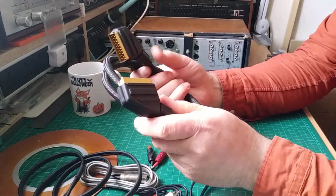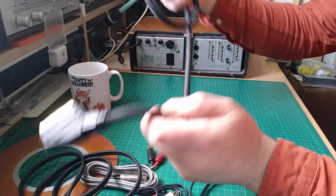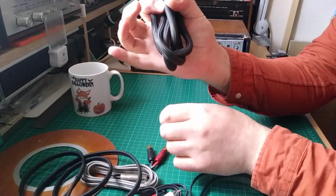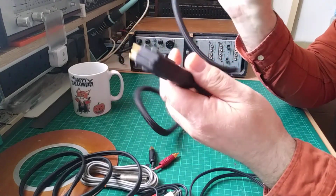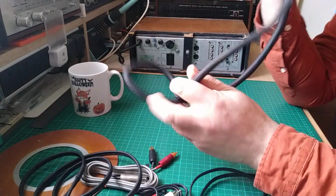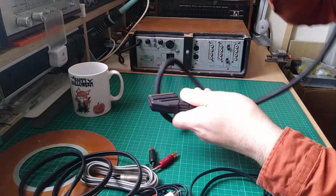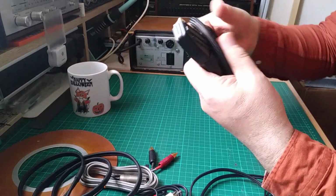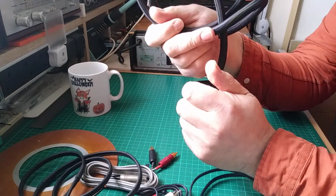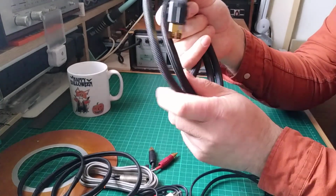This is one of the cables that I used to make when we used to make SCART cables, and as you can see, this is quite a flexible cable, and it's also quite a high quality one as well, because all the conductors in the cable inside here are all individually screened, and they're all properly terminated, because as I say, on some of the cheaper ones of these, it's just basically a multi-core cable with just a thick rubber sheath, and as I said, very, very poor screening